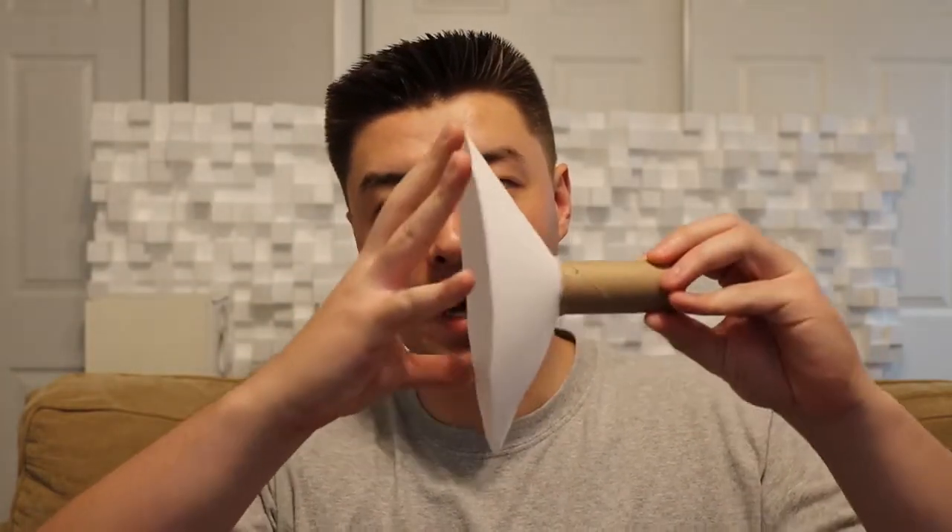So now we've seen a few different driver shapes, and the cone is superior — who would have thought? What's wrong with the other designs? The cone gives the structure rigidity. Two things you want in a driver are low weight and rigidity. Low weight so it can move fast. The lack of rigidity is the reason why driver shapes like the square flop around when being moved.